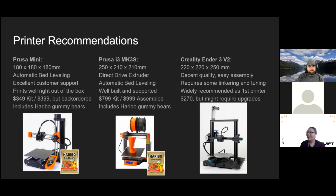There's another question asking how many hours you've dedicated to learning how to 3D print. Oh, so many. It's hard to quantify because there are times where you'll be trying to print something and it won't stick to the bed, or it'll get to a certain point and the whole print will fail and you might end up with spaghetti. But everything's a learning experience. If it pops off the bed, you might learn, oh, I have a draft in my room, so I can't let cold air blow across the printer because that'll cause the edges to curl up and the whole thing will come off or be ruined. Or when you're trying new materials, you might have failures where it pops off or there's a mechanical failure, like a layer shift, and you get a bunch of spaghetti.